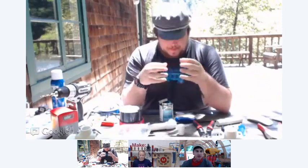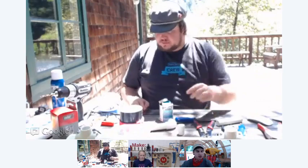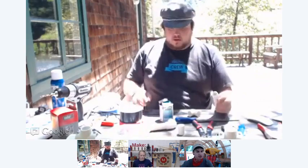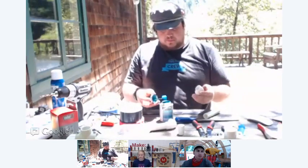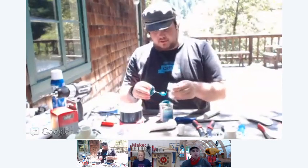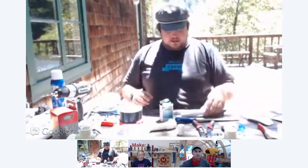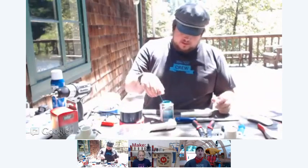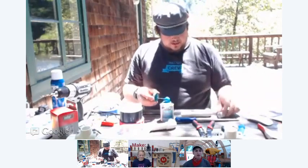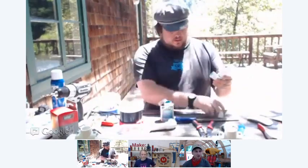And you can also do the pressure test, right, Ben? You can get some soapy water and try to fill up the combustion chamber with pressured air, see if the bubbles form on the outside. A good way to test for leaks. That's only really necessary for air cannons, because they need to be perfectly sealed. With combustion cannons, it's okay to have a couple of leaks, because the reaction happens so quickly that if the leaks are small enough, it doesn't have enough time to actually affect the performance. Okay, so if you are designing an air cannon versus a combustion cannon, there are some different things to consider. Yeah, there's different tolerances. Okay.